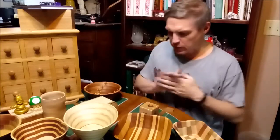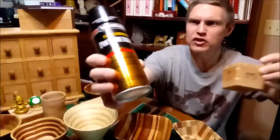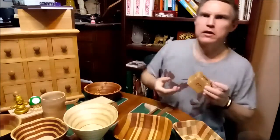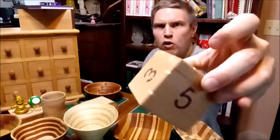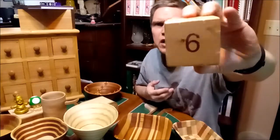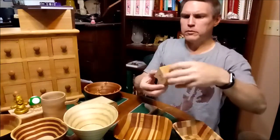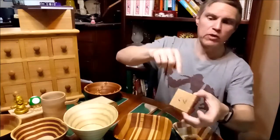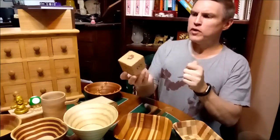So anyway, going to the box that I did finish, which is right here, I finished it with just some spray on polyurethane, nice, simple, and quick. I can get a couple of coats on in a short amount of time. I think the box came out looking overall pretty good, despite me messing up the ink transfer in a couple of spots. Overall, I'm pretty happy with it. As you can see, adding the polyurethane deepened the colors, although looking at it now, I would have tried a brighter color, maybe a blue, for the transfer. I think that might work a little better.